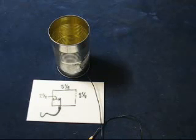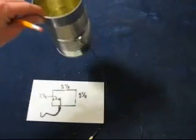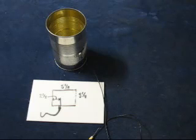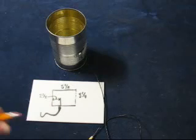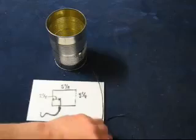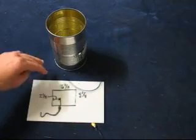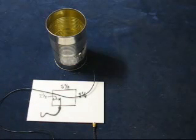block the signal entirely. Another tip is to get the antenna as high as possible, because the closer to the ground, the more objects there are to block the signal. So if you're trying to get a signal from 1,200 feet away or whatever, any bushes or trees or things in the path will attenuate that signal. Another tip is the antenna cable should not be any more than 3 feet long, because the high frequency is attenuated in that cable length.